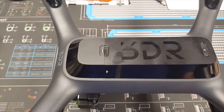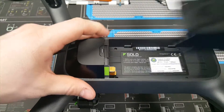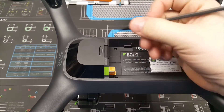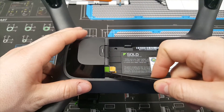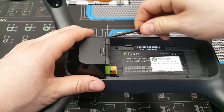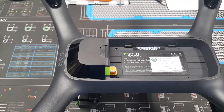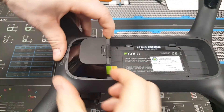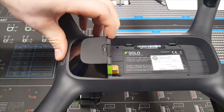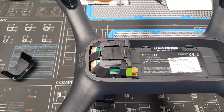Let's go ahead and get to the actual install of the new GPS isolation plate, shield, and GPS module. First thing we're going to do is slide the top of the battery off the Solo. Then using one of these plastic pry tools, go directly underneath — there's a little slot where you just pop it and give it a little twist. I like using these because it doesn't damage any plastic. With that pried up, just pull up on these two sides and it pops straight up.